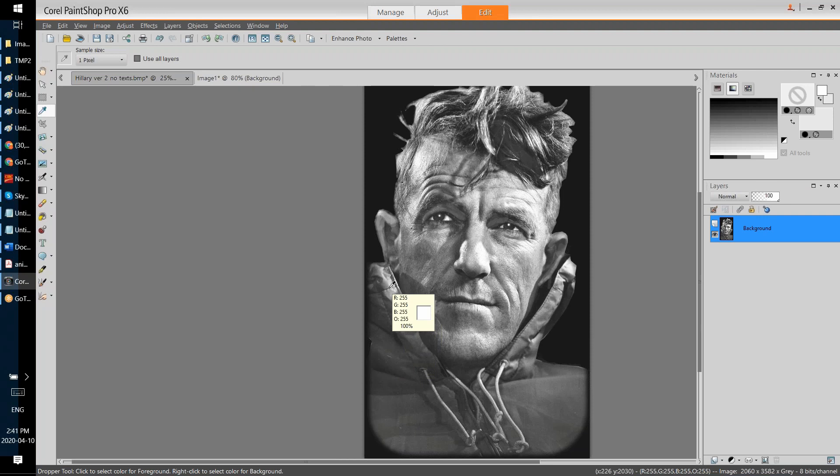To summarize: there are two objective tools I would recommend for ensuring that your image is correctly color balanced. One is called the color histogram, and the other is the spot-checking tool called the eyedropper. Make sure your images are correctly color balanced before you feed them into the machine, because even if your machine is set up perfectly, an incorrectly color balanced image means you are not guaranteed to get an engraving that is as bright and good looking as it could be. As for color histograms and image editors, I'll probably shoot a separate episode covering the variety of raster image editors available.